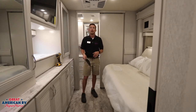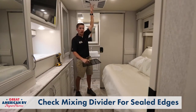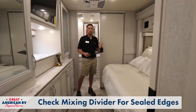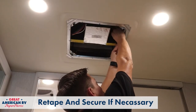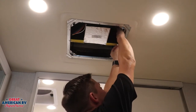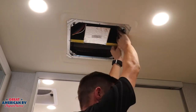Make sure this is good and clean, and from there you can also remove the ceiling assembly right here and check the center divider in there. That should be checked maybe once a year. We have what's called tinfoil tape or HVAC tape, and that tape's adhesive will deteriorate a little bit over time and will allow air to circulate between the two, which can cause your unit to freeze up.